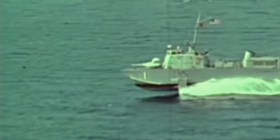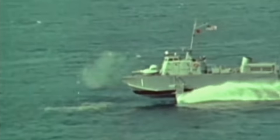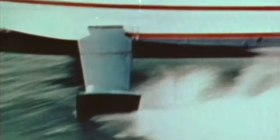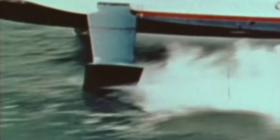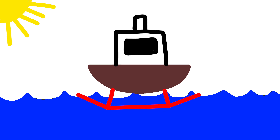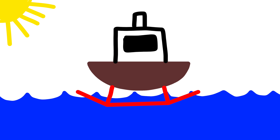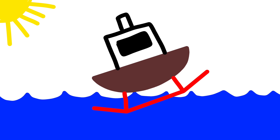So what exactly is that? Hydrofoils are basically just wings flying underwater. Like airplanes, they can be cleverly designed to have passive stability, where the vessel has a natural tendency to keep itself upright. This is usually done with surface piercing foils, where the lifting surface penetrates the water. The lifting force varies in relation to the depth the foil is submerged, so as the boat tilts to one side, the foil from that side becomes more submerged and therefore generates more lift, which rights the boat.